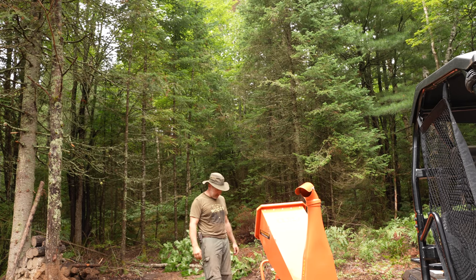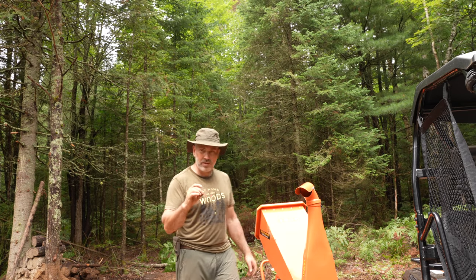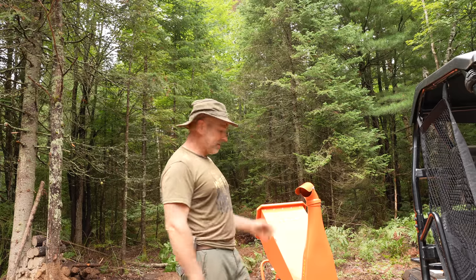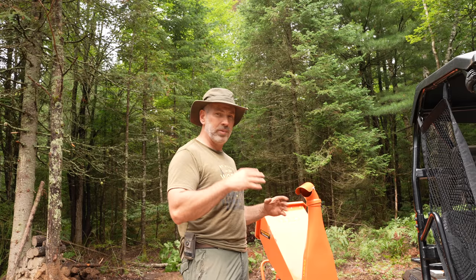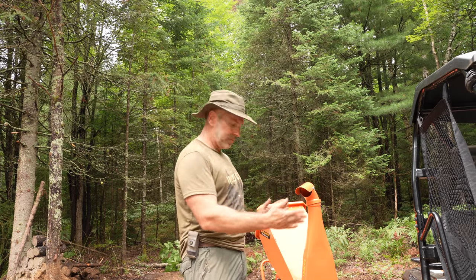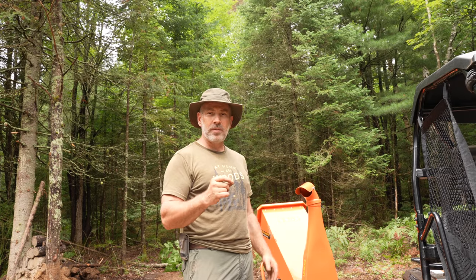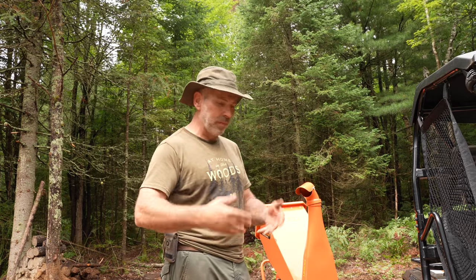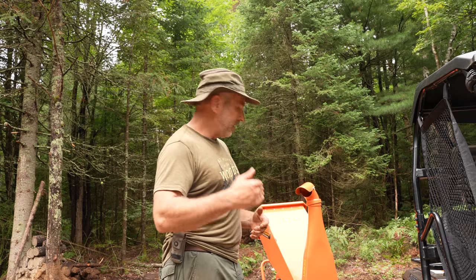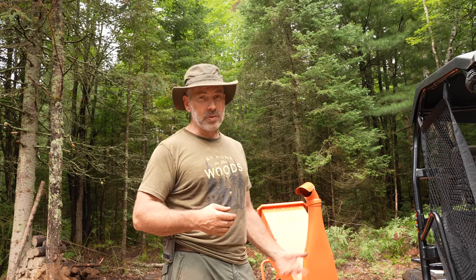Not much for that idea. That's 2 inches of hardwood, and this thing, I guess it jammed, but it broke some bolts. It's got 2 blades inside, full width of the bottom of the hopper, and one of them bent. It looks like the bolt broke, there are 6 bolts in each one, and the blade was bent out, and it looks like it must have come up as it was spinning. It must have hit against the steel frame of the hopper and stopped the motor dead, and it broke off a few bolts, and I can't even see where they came from.